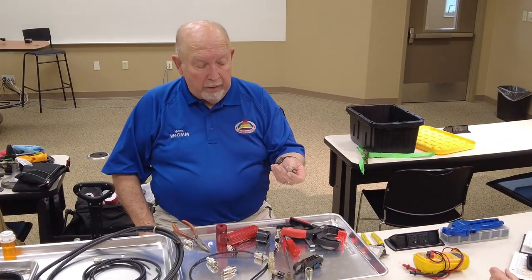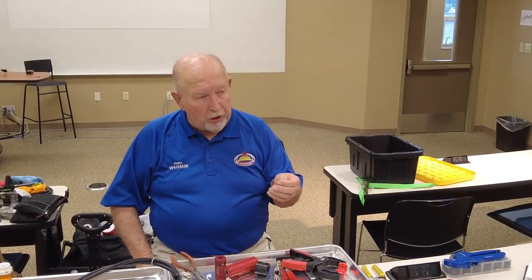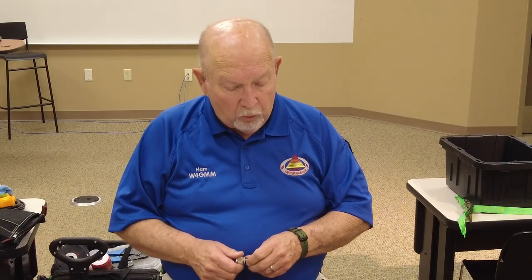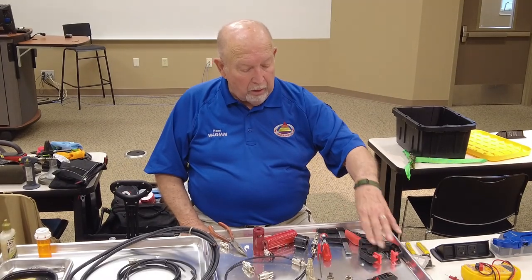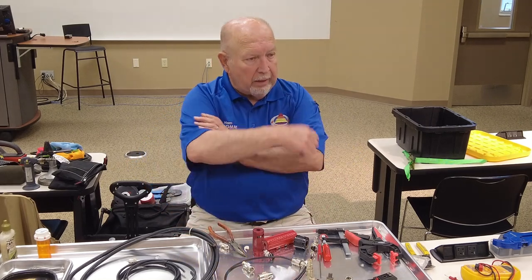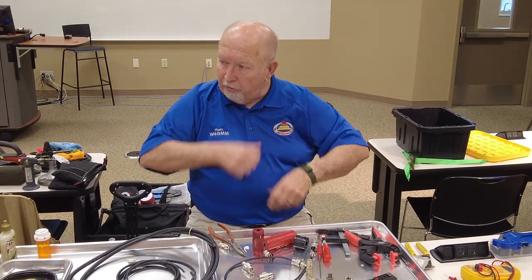Now, N connectors and BNCs. I have never put one on, and I don't know of any reason why. You just use an adapter, right? Yeah, I don't know of any reason why anybody would want to do it. We did it a lot when I went to Atlanta to work video for the Olympics. We used a lot of BNC connectors like that, but they were all crimp-ons, and it was just easy. Just strip it, stick it in there and crimp it.